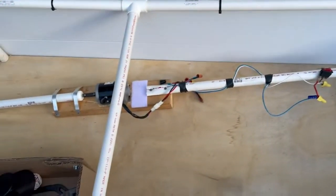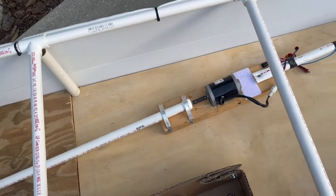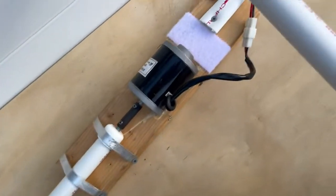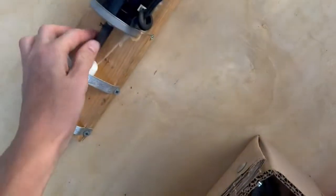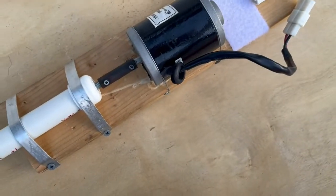I'm going to do a video on my homemade trolling motor. Basically it's just a piece of all-thread that I bought at Home Depot, attached to a motor that came off of an electric scooter someone was throwing out because the battery was dead — just a regular Razor electric scooter. Part of that scooter's rear axle was a little spacer piece that was the perfect thickness to fit the all-thread and the motor shaft, so I hooked the all-thread up to the motor shaft.